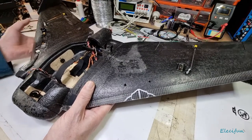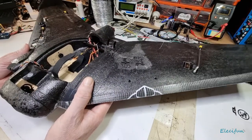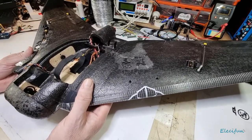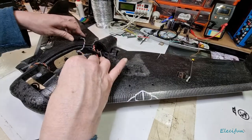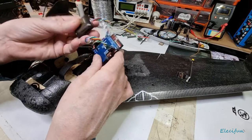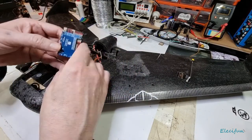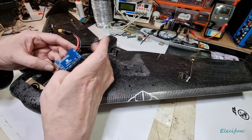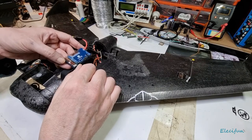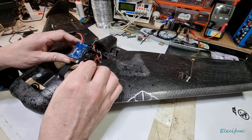And you've got to get your manual mode set up before you start relying on auto launch and bits and pieces. So just to have it go up in the air from a straightforward setup, you don't even have to bother with any of this to start off with. You can just have this in here, have your servo set up, have your ESC set up, of course, coming out of here, and your servo set up on here, your receiver, and if you want your FPV gear in there, start off.